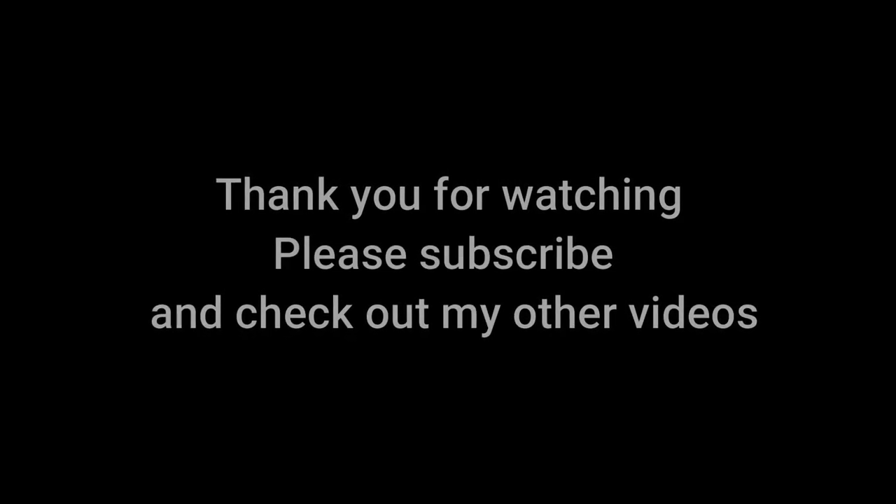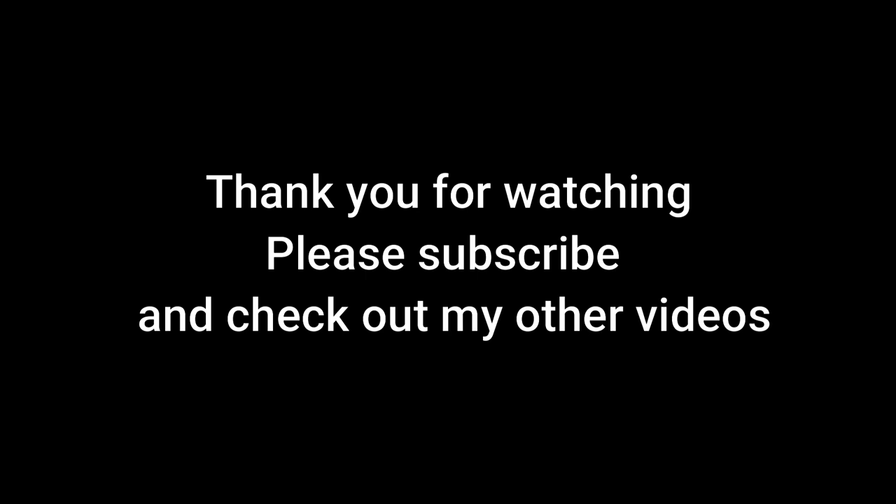Hey everybody, thanks for sticking with me and watching this video. I've covered a lot of topics here — the common mode chokes, the active antennas, and some of the differential GPS and things you can hear in the longwave bands. I've spent a lot of time there over the years experimenting. One quick comment: the ferrite cores — if I was to make new common mode chokes for the longwave bands, I would concentrate on either number 77 or J materials, which give an awful lot of inductance per turn. My third choice would be number 75. Thanks again for watching, please subscribe — I'm trying to get to a thousand subscribers. This is W1VLF signing off, 73.